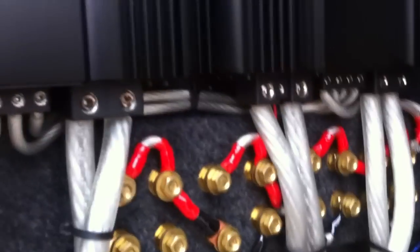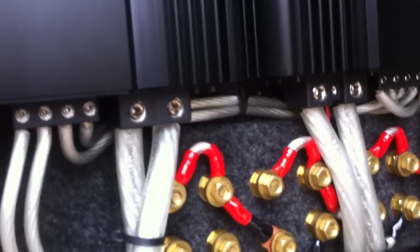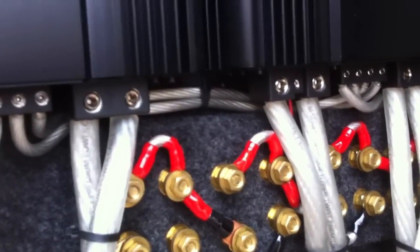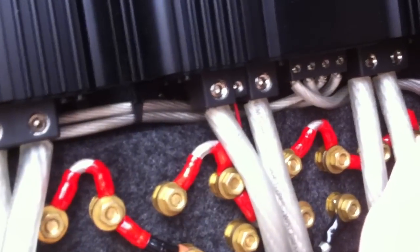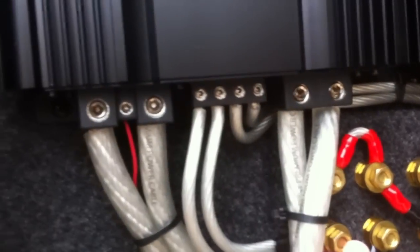That's why it's helpful to have the diagram when you're wiring it up. If you take your time, it's really not that difficult. Just make sure you connect both negatives together with the link cable, the positive of the master goes to the positive of the voice coil, and the positive of the slave goes to the negative of the voice coil. Then set all your gains and everything accordingly on the master side.